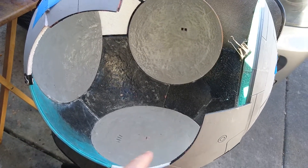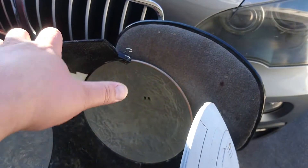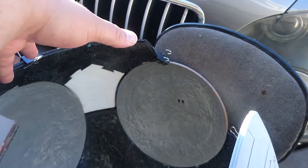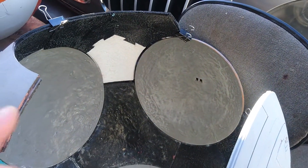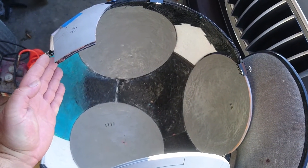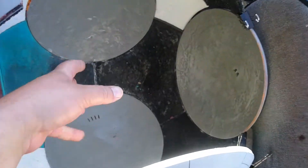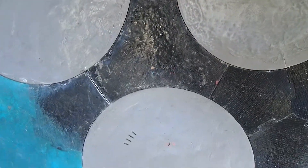I'll have to install this panel here, and then what I'm going to be doing is taking these triangles — these ones here and these ones here — and attaching them to the ball, or to this circle section panel section here. That will be removable so I can get into the whole thing. It'll probably be about that much workspace so I have room to change batteries and do whatever I need to do. Once I get this all glued together, I'll be fiberglassing it — like this is here — and basically putting another coat of fiberglass on the inside and then doing the aluminum gel coat on the inside to get it all smoothed out.